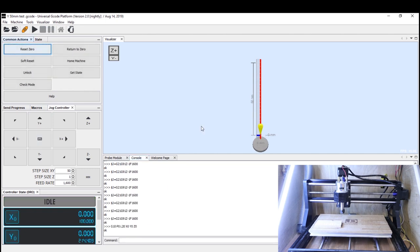At this point we could also calibrate the Z-axis, but we're leaving it until last. The Z-axis needs to be the most sensitive because it can cause the most damage — it can either jam the bit into the wood or break the carriage. So we'll calibrate the top speed for X and Y now, and then come back to the Z-axis to do both calibration tests for it at the same time.